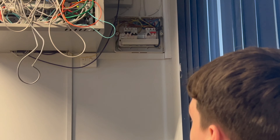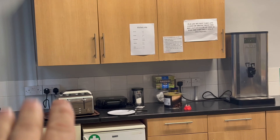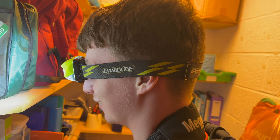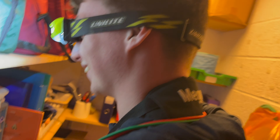There's one ring main as well. One thing I want to check — it does the sockets on a 6mm cable, so I presume it probably comes down there. Just check the connections, make sure it's all 6mm or they've extended off the ring. Ebzy didn't charge up his head torch and has borrowed mine — look how loose it is!